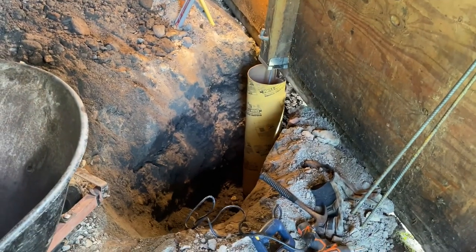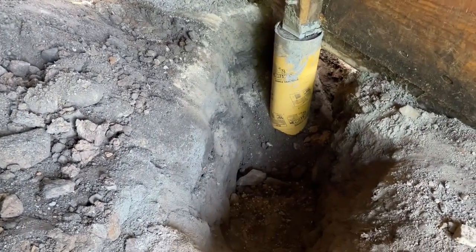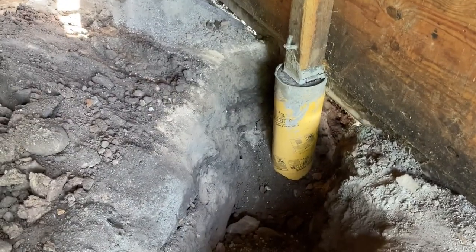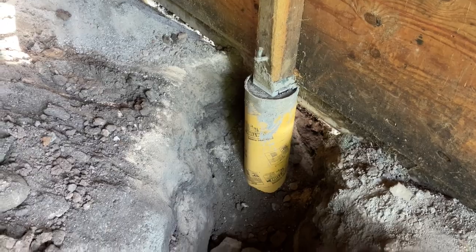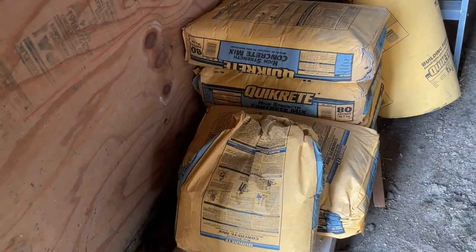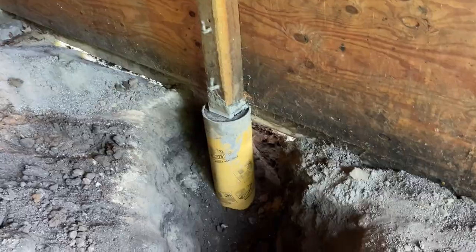That's where we are - let me pour and I'll catch up. That's the day after the pour, letting everything cure up, started filling in a little dirt. What I ended up doing is I put a full bag down the bottom of the hole, the sonotube was in there, put some in the middle, then filled that tube - a 48-inch tall, 10-inch diameter sonotube - all the way up. I used four and a half bags of 80-pound Quikrete high-strength, which is made for columns.